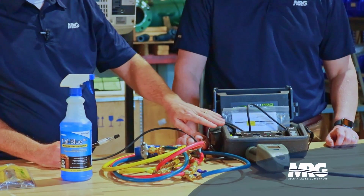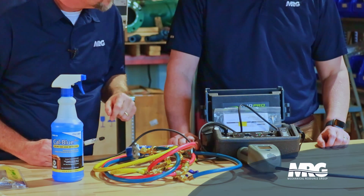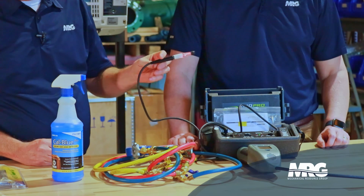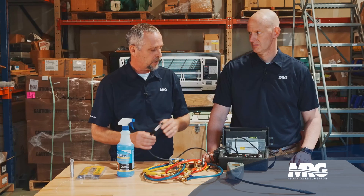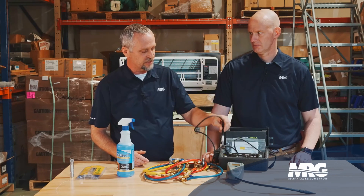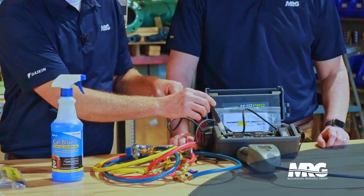This Bacharach has a little calibration bottle that comes with it. Initially you have to set it up and make sure it's calibrated right for sensitivity. It has a little test bottle with a small hole, and a silver disc sticker you put back on after calibration. You turn it on — it should start on the low setting. As you get closer to that calibration bottle, it should start ringing out. If I opened it and it wasn't ringing out, I'd know it needs calibration. There's a little heater adjustment — increasing or decreasing that heater adjusts the sensitivity.